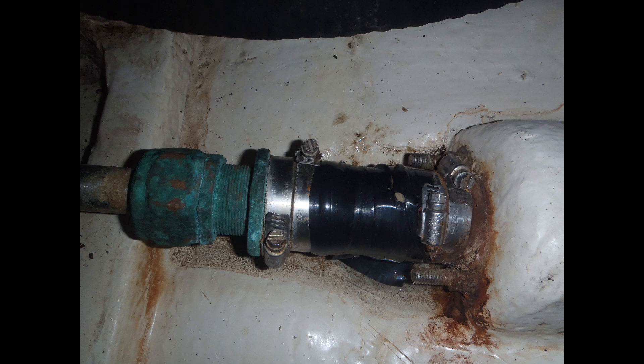This is what can sink your boat — it's a below-the-waterline fitting keeping water out. During the sea trial, water was just pouring out at each end of the electrical tape. The recommendation, of course, is to replace the shaft log hose. It's a bit of a job: you've got to pull the boat, disconnect the shaft from the transmission or reduction gear, slide it out, and then add the new section of hose.